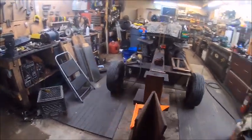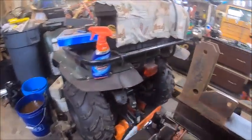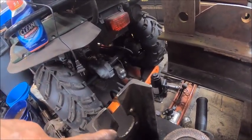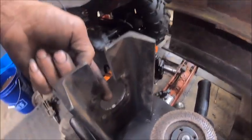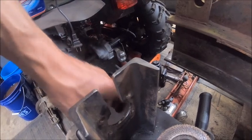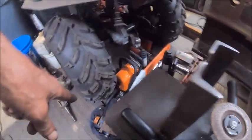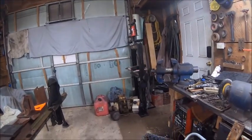On the pump, when I had to take it off, because that Lovejoy connector was seized on there, it wouldn't come through this hole. So I had to make a slot big enough that I can get the shaft up out of there. So once I unbolted all, I had to just lift it up out of there with the Lovejoy on it, because I had to get it off somehow in order to get the thing in the press.